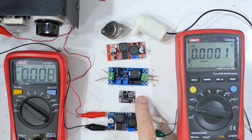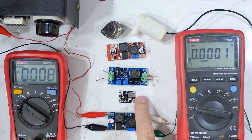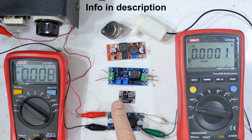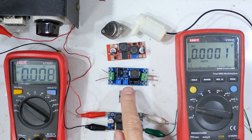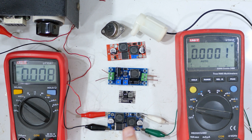The big difference is efficiency — these are in the 90-percentile type efficiencies. So you put in somewhere between 12 and 6 volts and out comes 5 volts. This one is similar but notice it's got two adjustments: you can adjust both the voltage and current, whereas the other one you can only adjust the voltage. And this one is pretty much a twin of that — just a slightly different voltage range. Okay, let's turn on the power and make this work — let's crank our demo.